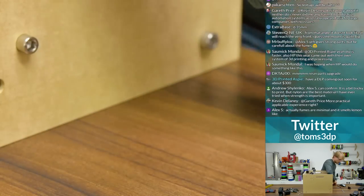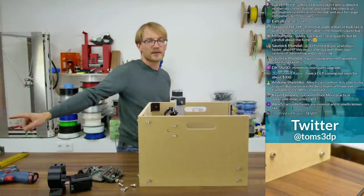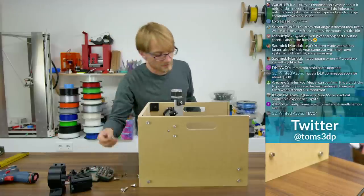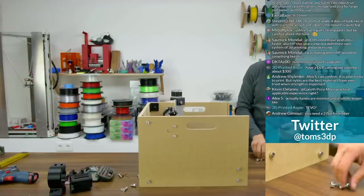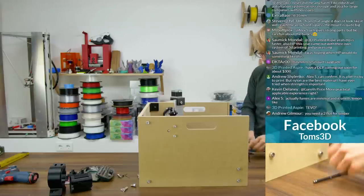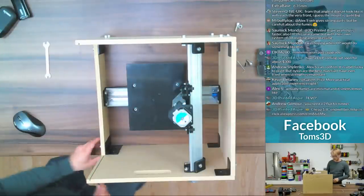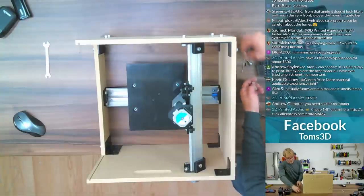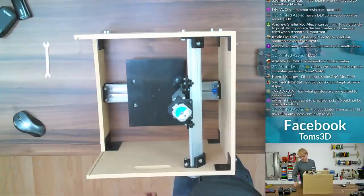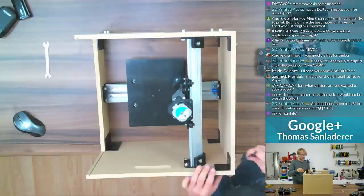But in the long run, I do want to switch to 1/8 inch bits, just because they are the cheapest stuff you can get. These are 6 millimeter shank ones. The 1/8 inch ones are just a lot cheaper. And you can get an adapter from 1/4 inch to 1/8 inch, or from 6 millimeters to 1/8 inch. You just drop that into the 6 millimeter or 1/4 inch collet and you're good to go. You could get a different collet for these Makita routers, but to get a 1/8 inch one, you have to get the custom made boutique type ones, which are more than $40 for the collet, which is almost half as much as the router costs, and I'm not paying that for a collet.